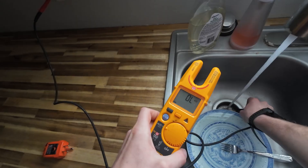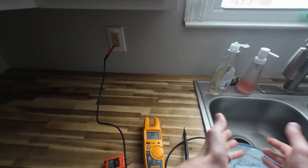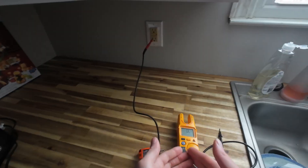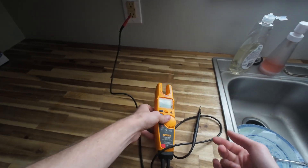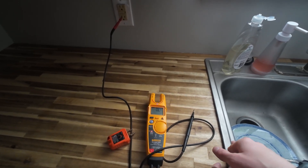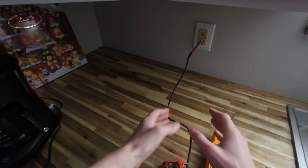So we have no ground path. Why do I care? Well, if there is a ground fault — the reason we have GFCIs by a sink is that if water comes in contact it's going to be energized, and you would have a short that would trip the breaker. Well, not in this case. There's nothing. So the water system can become energized and could electrocute you. I don't like having no equipment ground or a crap ground connection right next to the sink.